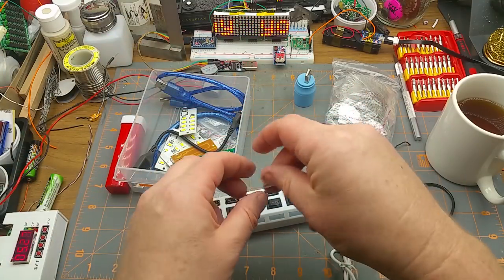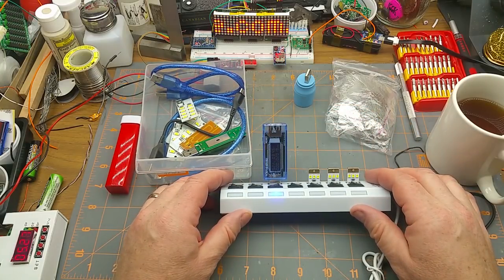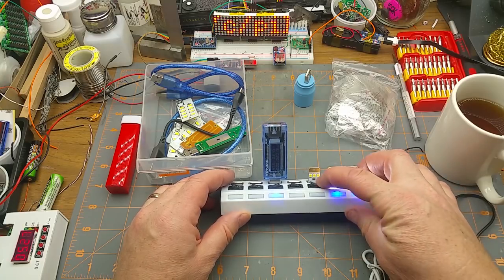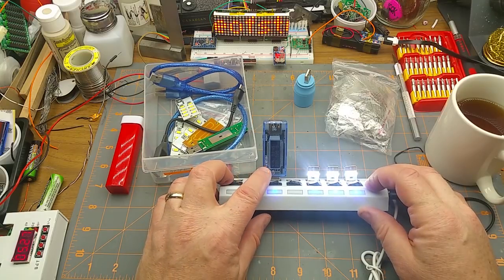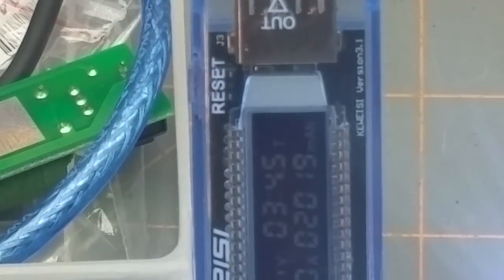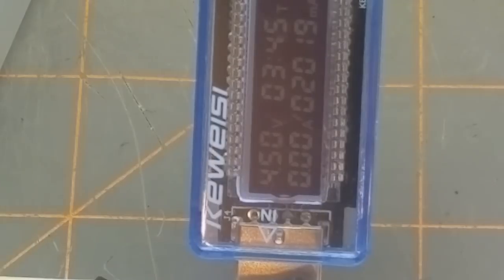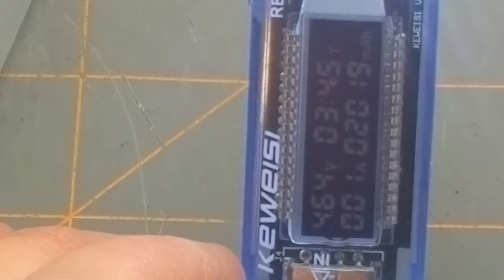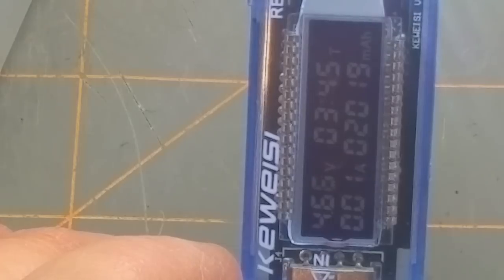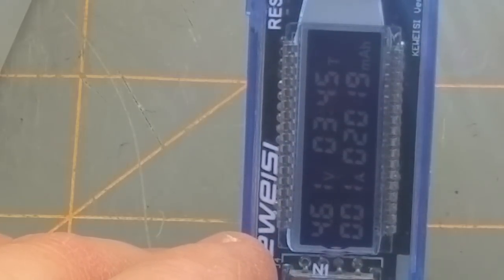What else do I have in here — oh, another one. Let's plug this in too. See what it says — 5.21 volts, zero milliamps. Of course, turn some of those on. It's dragged it down to 4.1, 4.2 volts. That's not great performance. Let's turn one, two, three of those off. Just put that one up there — does it draw? 10 milliamps — and even with just that in there it's drawn down to 4.6.